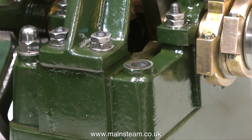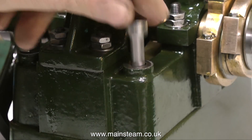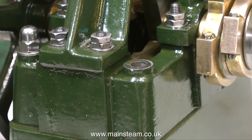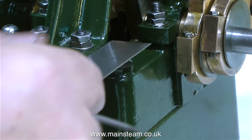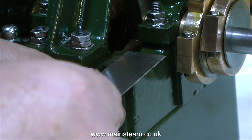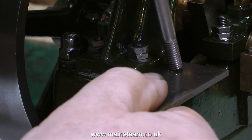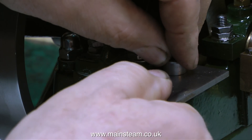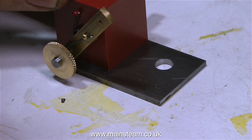The question is, where do I mount the lubricator, and how do I mount the lubricator? I don't really want to drill into the casting. So what I'm going to do is use a substantial metal plate to mount the lubricator on, and then I'm going to hold this plate in position using one of the bolts that holds the sole plate to the box bed. I've drilled a hole in a piece of metal, and I think this will work fine. When it's all held down there, it's going nowhere — it cannot move because it's hard up against the casting.